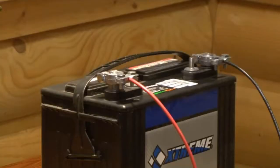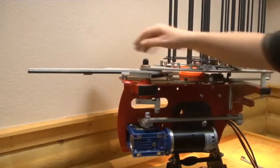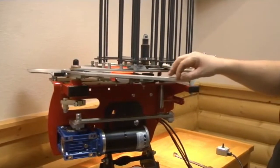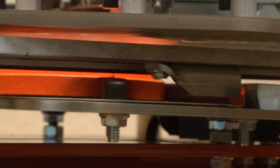Leave the battery connected. Place a clay pigeon on the softfall plate, which is located on the throwing plate. Push the throwing arm counterclockwise so that it stops against the side of the clay. There needs to be a gap of about a 16th of an inch between the underside of the throwing arm rubber and the horizontal shoulder of the clay.